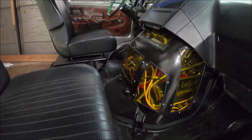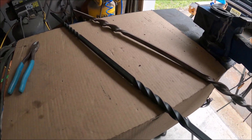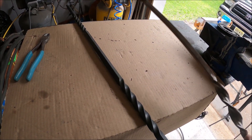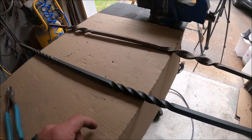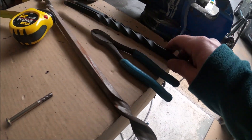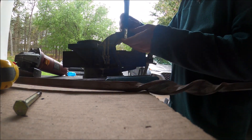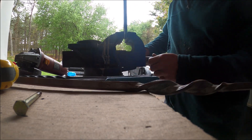Now I think we're gonna move on — gotta do something about cup holders. Cup holder time. I remembered that I bought one of these; I thought it was aluminum but it's magnetic, so that means it's not aluminum — at least it's metal so we can weld on it. First thing I'm gonna do is cut this in half and get two equal pieces. Now I have two identical pieces — the only thing I did was weld a nut onto the end of these, and you didn't miss anything other than me cursing when I grabbed a bolt after welding and it burned.